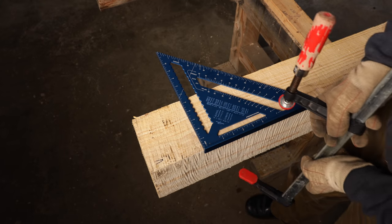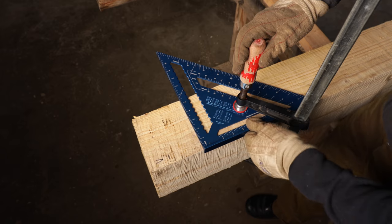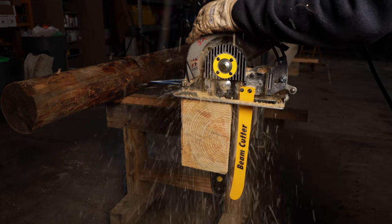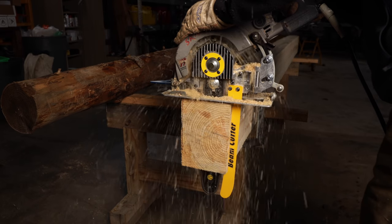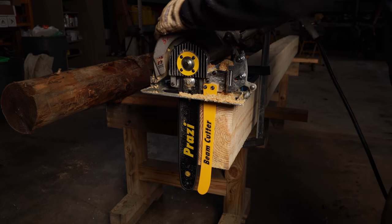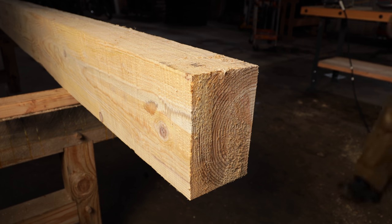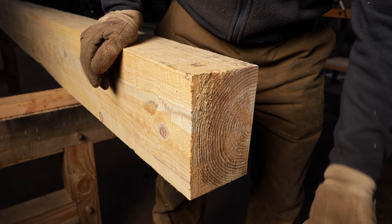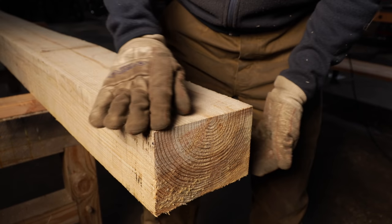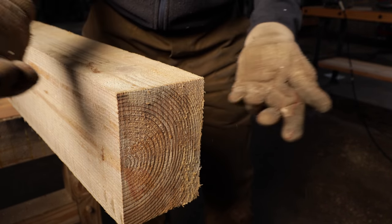I'm going to use this big speed square here as a guide. If you want real precise cuts with your skill saws, this is kind of a pro tip — you can use a speed square or something like that to give you a guide to go along. Well, that was actually quite nice. Very smooth, very balanced, easy to control. I'm totally shocked at how clean the cut is. I was expecting a lot of tear out. Let's flip that over — that's as good as a guy could expect. Look at the exit on the back end — no tear out, nothing nasty.